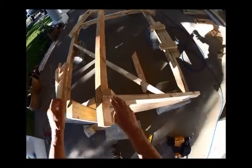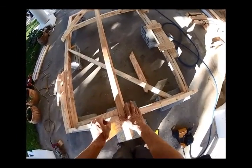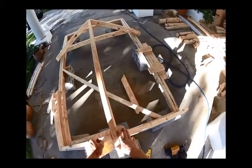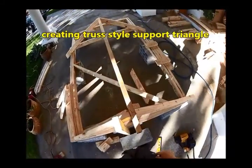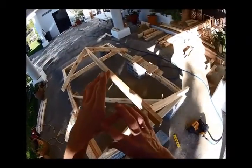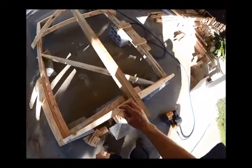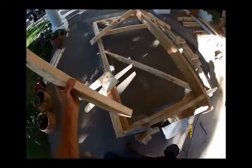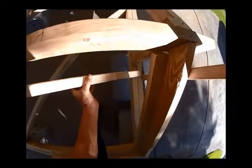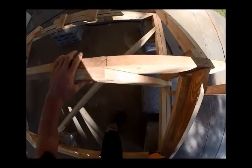The other thing we need to do — if we're vertically bracing this and there's a bearing wall in the middle, we're going to put one every six foot. Otherwise if we've got ceiling joist ties, we don't need to worry about bracing the ridge because we're forming a little tiny triangle. As you push down on this, it's trying to pull out on that ceiling joist, and what's important in that case is the connection between the rafter and the ceiling joist has the proper nails. A sway brace would be cut at a 45 on the bottom, generally clipped a little bit, and I'm just going to shoot it right in here.